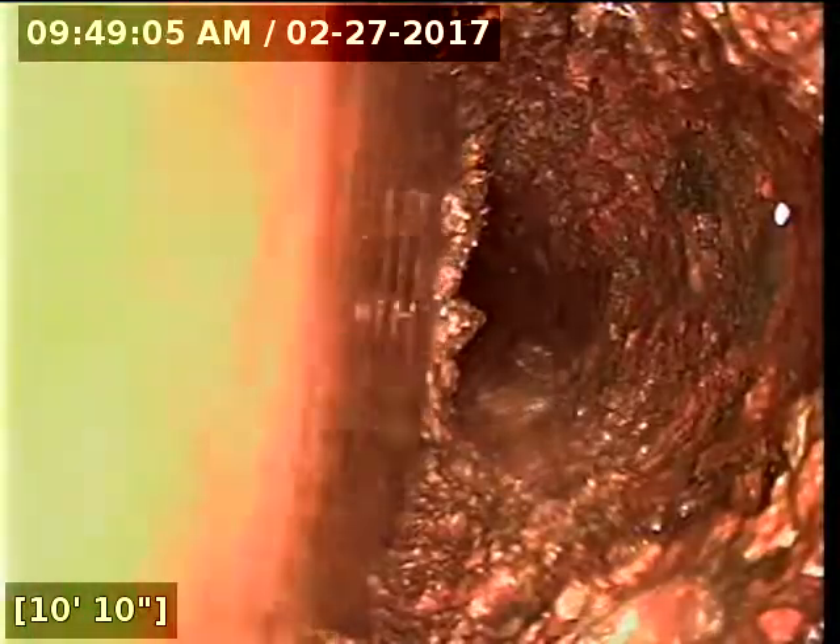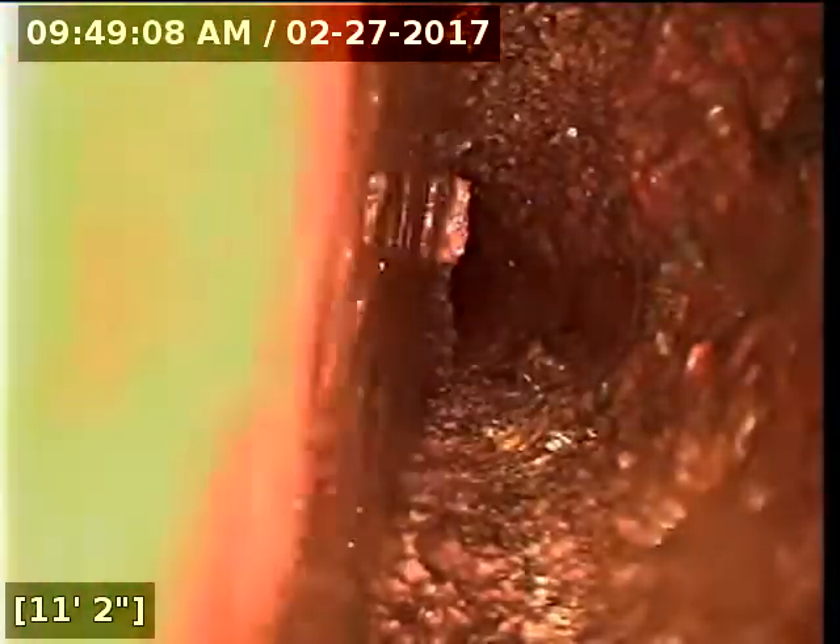We're able to get some of the scale to move down the line. You can see we've got water flow here — this is the kitchen stack. I don't see any cracks or breaks in the pipe, but it definitely needs to be jet cleaned. We're just pushing cast iron scale through here. We're not going to be able to get all the way through it, but water flow is good so we know the pipe's running good. It's definitely going to have to be jet cleaned, so let's pull back up this stack.